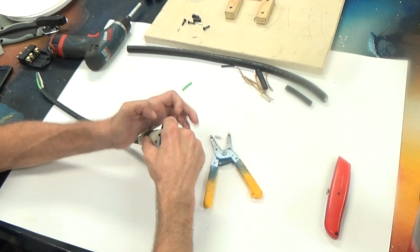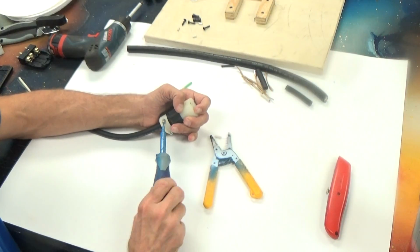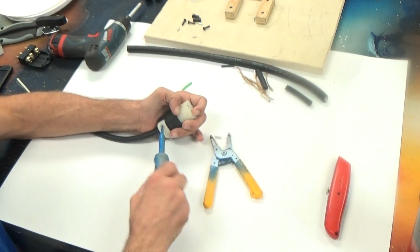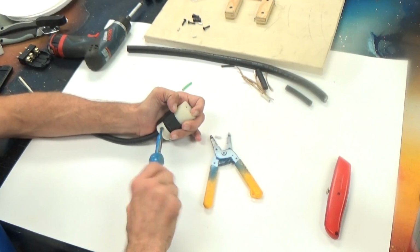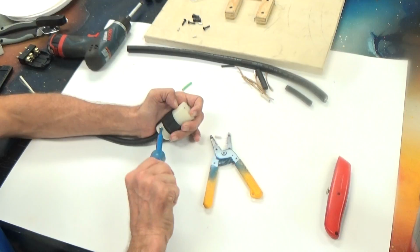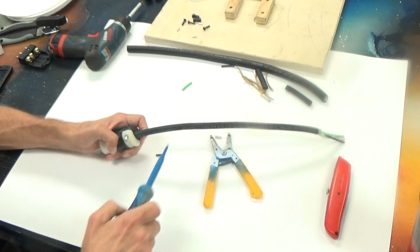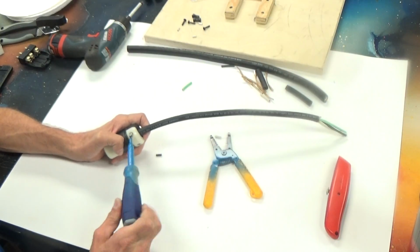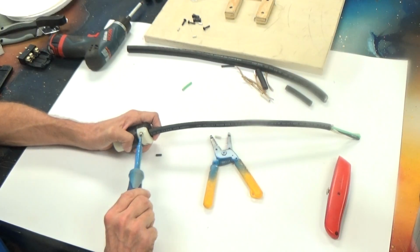And now I come around and I tighten these cable grips. And I will tighten these all the way down. They will go all the way down, almost regardless of the size of cable. Sometimes you'll look at it and think it won't fit at all, but it really will. You want to pinch that wire good. You won't damage any of the inner conductors, and you will make a nice, tight, permanent connection that will last forever if it's done well.